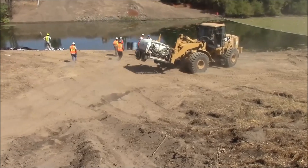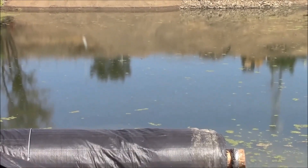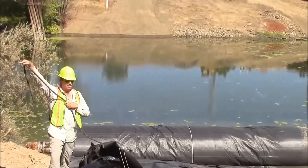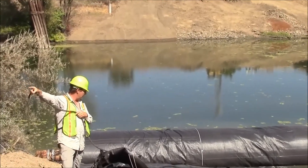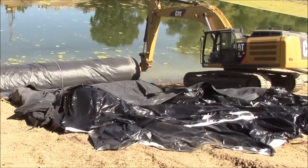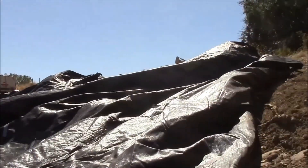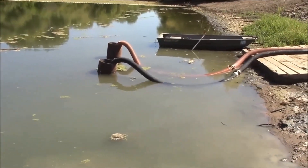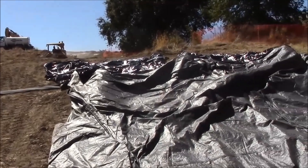We will begin by putting the discharge hoses of the pumps into the fill tubes of the aqua dam. The aqua dam needs to be adjusted more towards the left so that we get a better ending on the other bank, so a little tweak now to the position of the aqua dam is a lot easier than trying to tweak it once we get water inside it. Two pumps, two discharge hoses, one in each of the two fill tubes of the aqua dam, left and right.